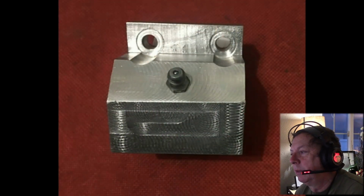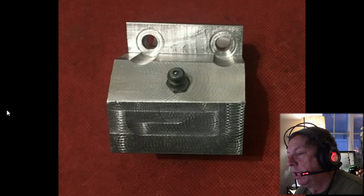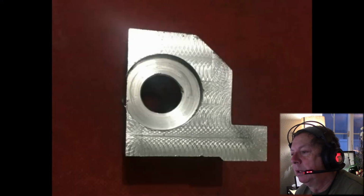Now let's look at this, and I'll tell you why I find this amusing. You can see the mill marks over it. This is a hunk of aluminum that somebody's taken some time to mill out. There's a grease fitting in it. The back's machined down, with a relief cut so it fits up against the bed the way it's supposed to. The end's been counterbored. This is pretty crude by even amateur standards, but probably functional.